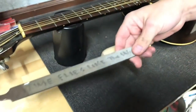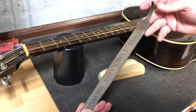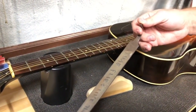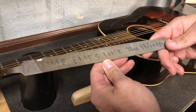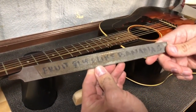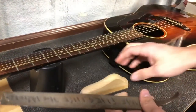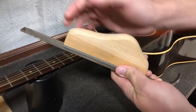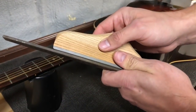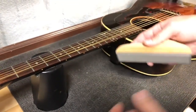You can also use alternatives — my dad was a really good luthier, and he would a lot of times just use a flat file he'd bent the end up on. He also at one time had taken one of these files and cut it down to about six inches, then epoxied it to a wooden handle that he made — one similar to this purpose-made one.